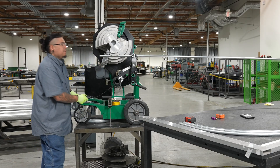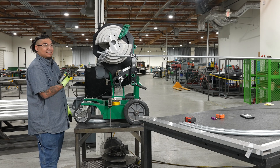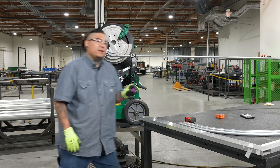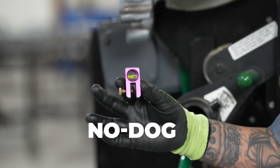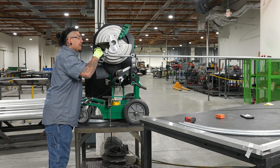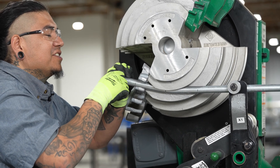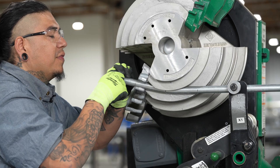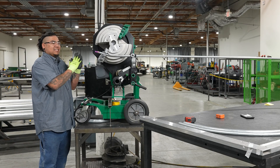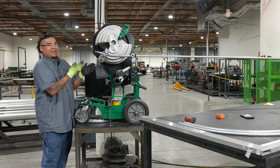We're lined up, and I'm going to hold my bender until it reaches the set degrees and stops. I do my first bend and then I grab a no-dog. This no-dog helps keep my pipe straight so that when I'm doing multiple bends the pipe doesn't go in multiple directions — it stays a true 90 the whole way through. I put it on now because the pipe is already at its final bend state, so this is what level will be for every other bend after this.